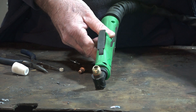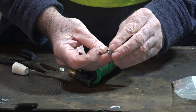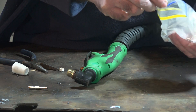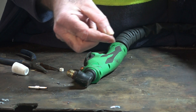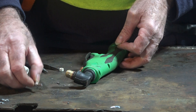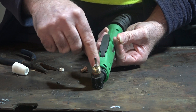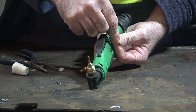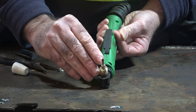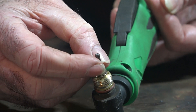What I did was go and buy myself a little bag of washers — they're just copper and exactly the same diameter as the electrode. It's a bit of a mission finding exactly the right size, but I found them eventually. They're only little baby things. So what you do is stick your consumable in like normal — you can see how it's slopping around because it's burned out the bottom of the torch — then grab your little copper washer and stick it over the top of your consumable, so it goes over the first notch.